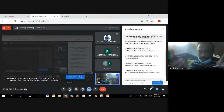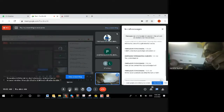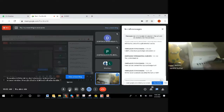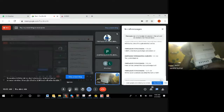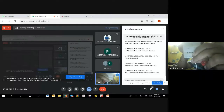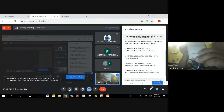Okay, if you notice it carefully, you have this terminal block here, and then it goes into these terminals. You can see it goes and connects on the bottom, and then we screw on top, right? When you tighten it, it gets attached here, and that's how it connects the physical inputs. Now you can see this red color push button connected to this input, and when I'm pushing this, the input will come here and the light glows here, and that's what one means. So that's what we are using in our logic, right?